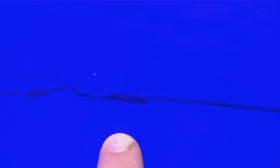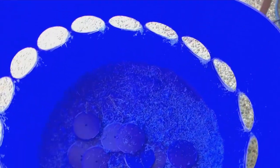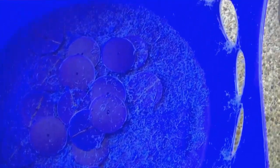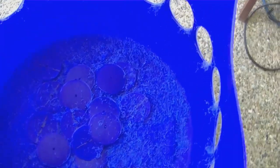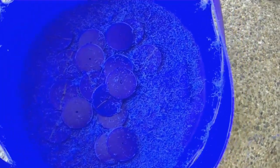You can see I've marked out a line — this is the line I'll use to centre the hole saw as I drill around the first run around the barrel. I've now drilled the first set of holes all the way around in a nice even level. One tip: drill from the inside, because then most of your waste will fall back into the barrel. It won't catch all of it, but you'll catch a large percentage, making cleanup easier.